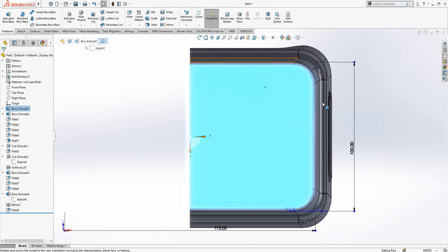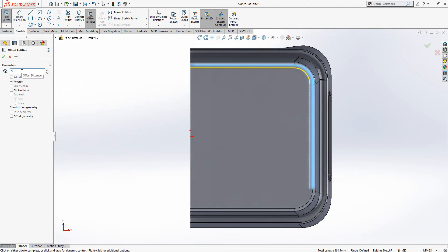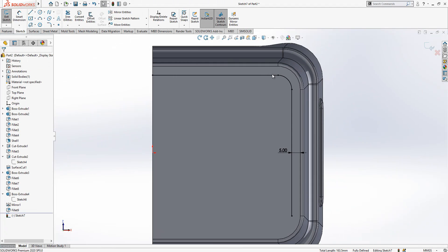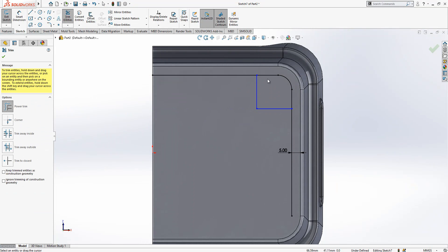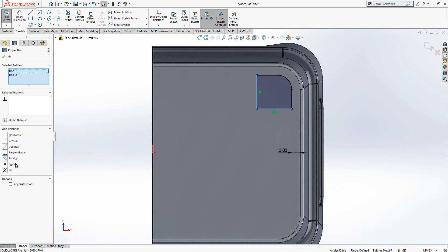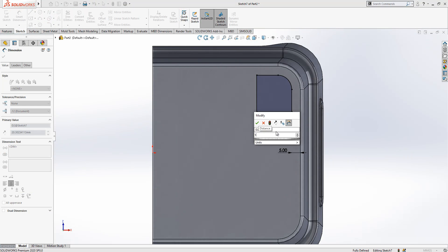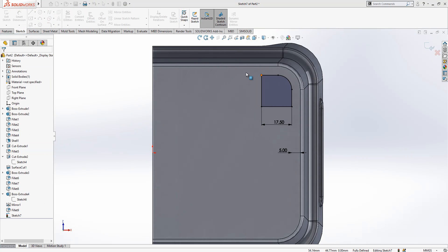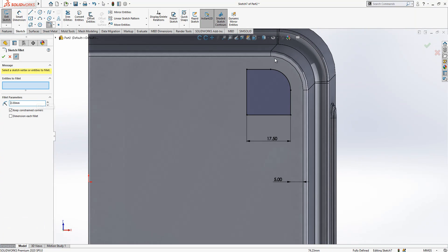For the bottom I have a new sketch. I select this, offset reverse, and set to 5. Then I will create two extra lines, and we can make these two equal. Something and a half — and I'm going to create some radii here as well.